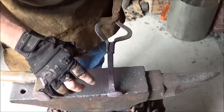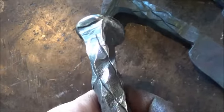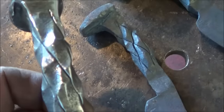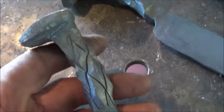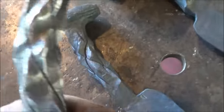I'm going to put a pineapple twist - my version of it. First thing I'm gonna do is heat it up, twist it one full turn, flatten that off, put in some center lines, twist it back a half turn. Before you all jump on my case: when I did the pineapple twist I did my version, which has a rope effect. The proper way - which I also demonstrate - has two sets of lines as opposed to just one. If you want the proper pineapple twist, you start by putting a center line on all four sides, then put your first full twist in, then flatten it, put your center line down through the flattened area, and then do a half twist back. That's Chandler's version versus the proper version - either one is beautiful.